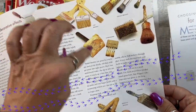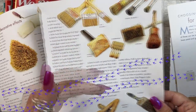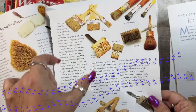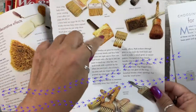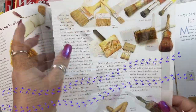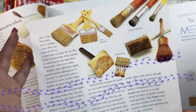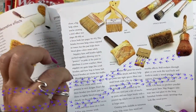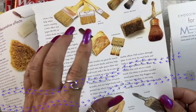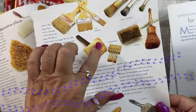Paint your base color, you let that dry overnight, then you put your darker color over it, whatever color your wood grain would be. It should be a couple shades darker than your base coat, usually. And then while that is wet, you put that down in strips, and you just rock this thing down it, and it just changes the wood grain on each of the strips that you paint. And I always take one of these old chip brushes. Cheap, you get them 3 for $1 at Walmart, because their bristles are stiff and kind of flayed, and then just lightly feather that wood grain. And no kidding, a metal door can look like a wooden door with ease with one of those.